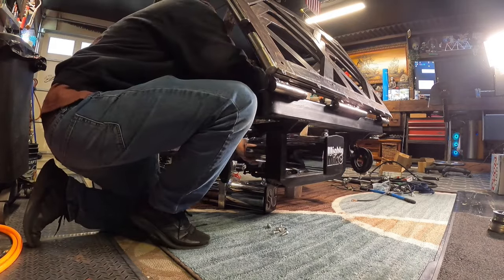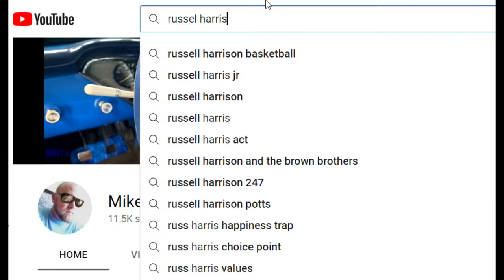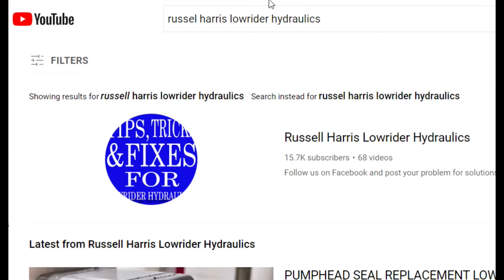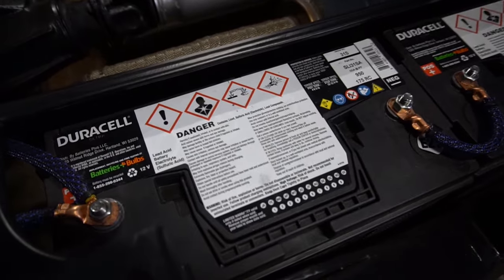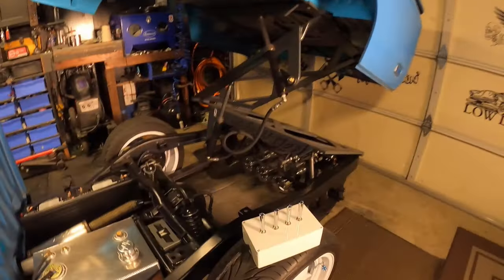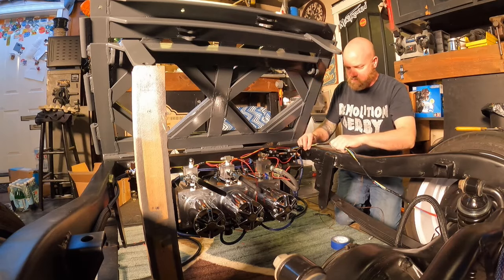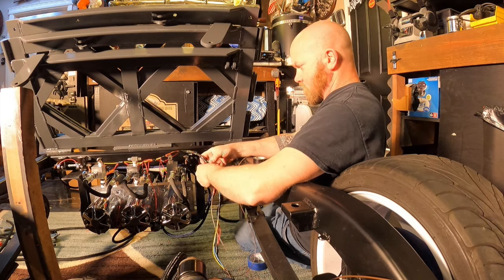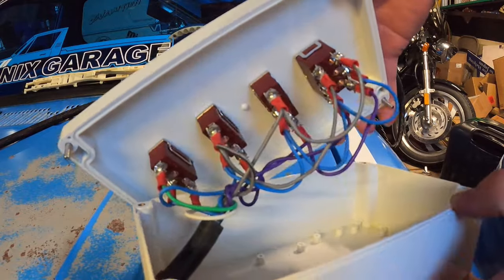That's pretty much how I did the rack. Next steps are hydraulics and wiring. I learned most of that from watching YouTube videos — my go-to channel was Russell Harris Lowrider Hydraulics. I got a lot of really useful quality information from that channel. The system I'm running is 24 volt, using two Group 31 950s, three pumps, and six solenoids — that's two solenoids per pump. Del Toro's custom hydraulic switch box really made wiring easy, and great customer service from Sergio led to a really easy solution. I highly recommend getting a pre-wired switch box from Del Toro Custom Hydraulics. I'm not going to get into the details of plumbing and wiring because there's plenty of content on YouTube for that.